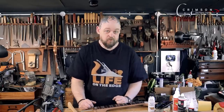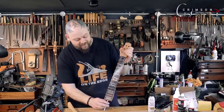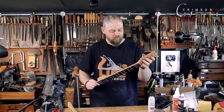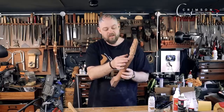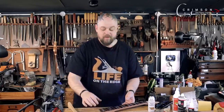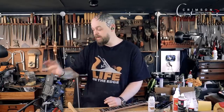But you know what? If you guys knew what I was going to do next, if I knew what I was going to do next, I'm not sure you would be here to watch. However, next in this episode, in this series, I'm going to cut the fret ends off. I'm going to put the correct bevel on them. I'm going to recarve a little bit of the neck shape, make the headstock a little bit thinner, and I am going to process down the top and the back at the very least, joint them together and start making material.